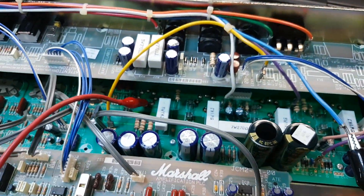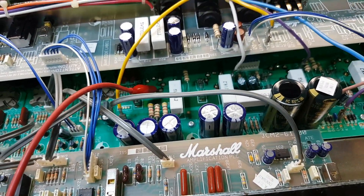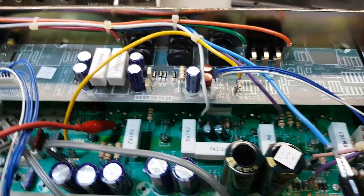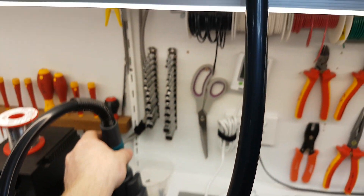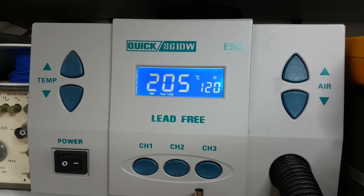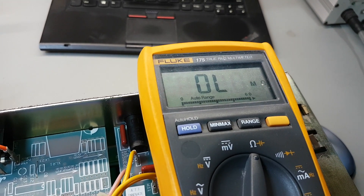What I'm going to do now is introduce some heat - this is all powered down, disconnected, the caps are discharged, the amp's not plugged into anything. It's just literally the meter and the amp, and that's it. I've got my hot air station - best one around, cheap too - set it to full fan, 200 degrees. Let's heat that area gently, try to keep it away from the caps.